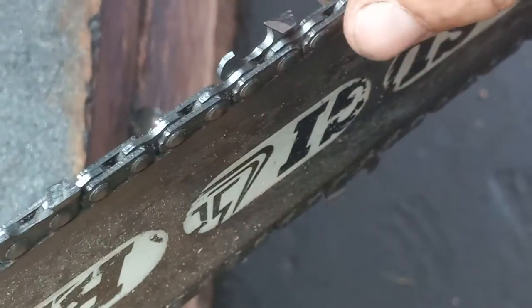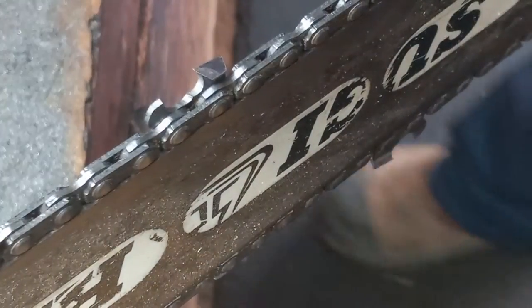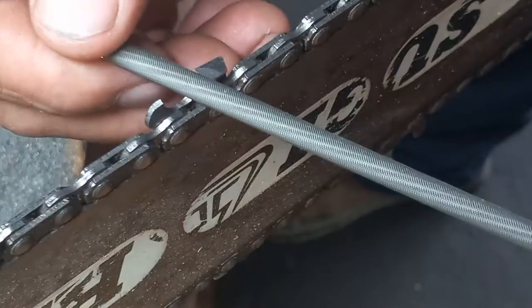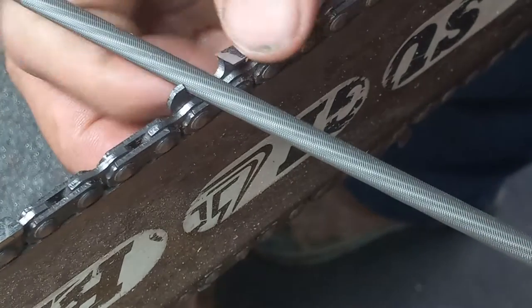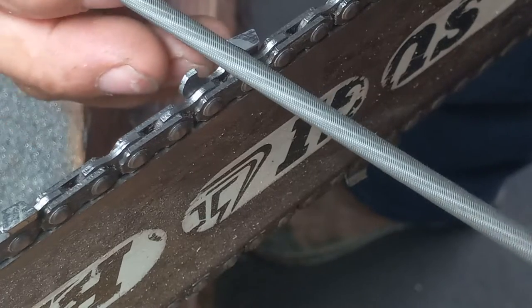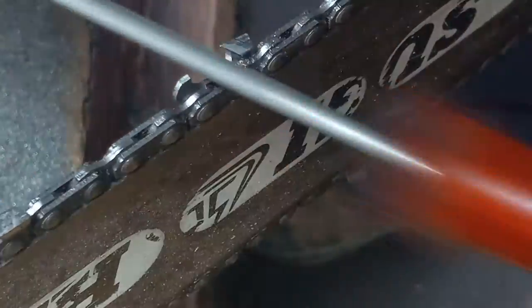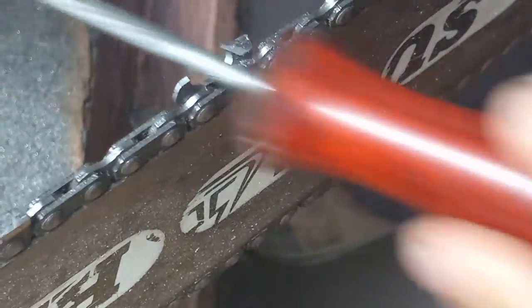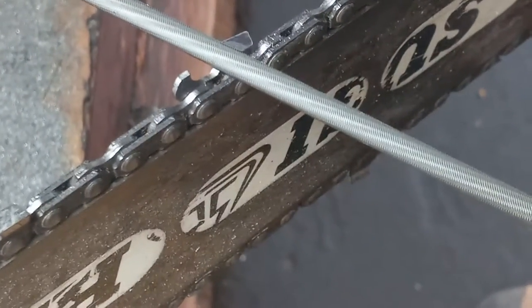Okay, here's our mark. It's just dirty. It may be awkward because the phone is just a few inches from my hand. What I'll do — you want to keep your file perfectly level with the tooth. I keep it perfectly level, I don't tilt it up or down. I keep it perfectly parallel, just deliberate strokes. Like that — that thing is perfect.